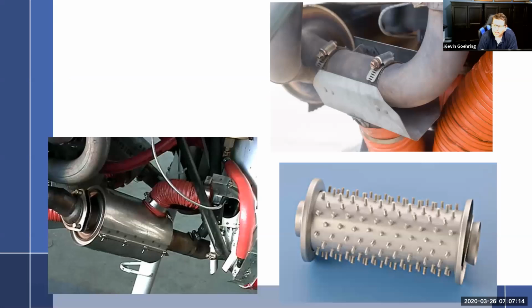Okay, so this right here is just different styles of exhaust systems, but pretty much what I drew is this thing right down here. So that's that thin outer metal. This is what's behind that metal. If we take off this, it's called a shroud, you're going to see this. All of this area with these little pins sticking out is the fresh, non-poisonous air, and then the poisonous gas goes in that tube and out this tube. This is how Lycoming does their carburetor heat. It's really kind of funky, but it does work.